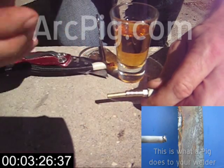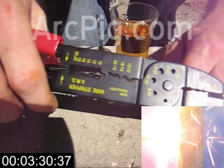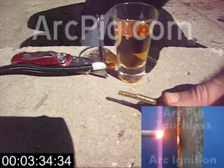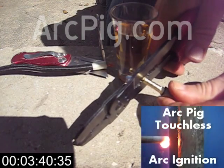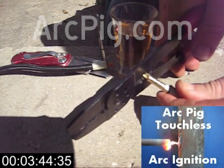For our parts kit, we've chosen a butt splice that is nickel-plated, seamless, and has very thin walls. The thin walls let the cooling water pass unobstructed, at the cost of a little bit of strength. But we've tested it, and if you crimp hard, the splice will withstand all but the most determined jerk. With that said, the Home Depot butt splice, which is thicker, will work as well — just be sure you leave a little room for cooling water.